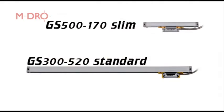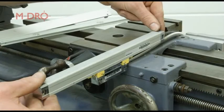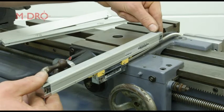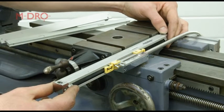With our linear scales correctly identified, if needed we can also select the appropriate protective covers. Before starting, work out where you would like to mount the scale so that it doesn't restrict the lathe, keeping in mind that the scale's rubber seal is not exposed. Ideally, face the mount seal away from the direction of any swarf and coolant splashes.